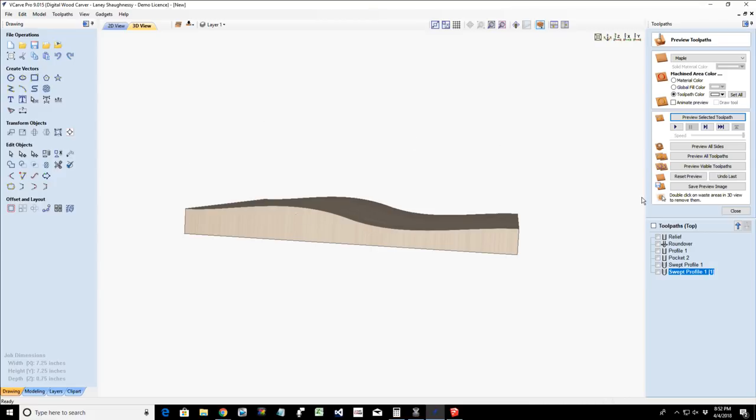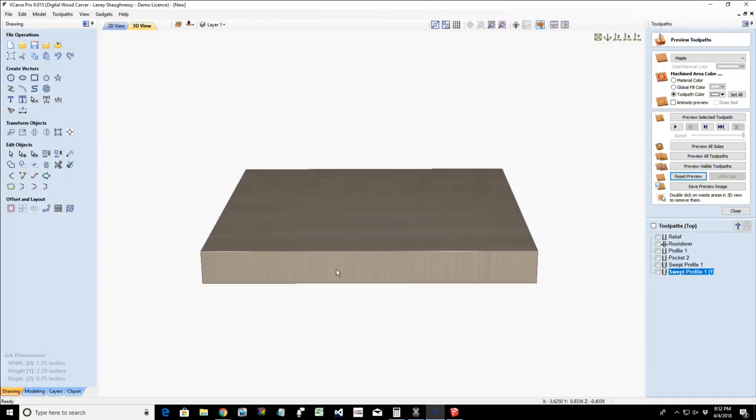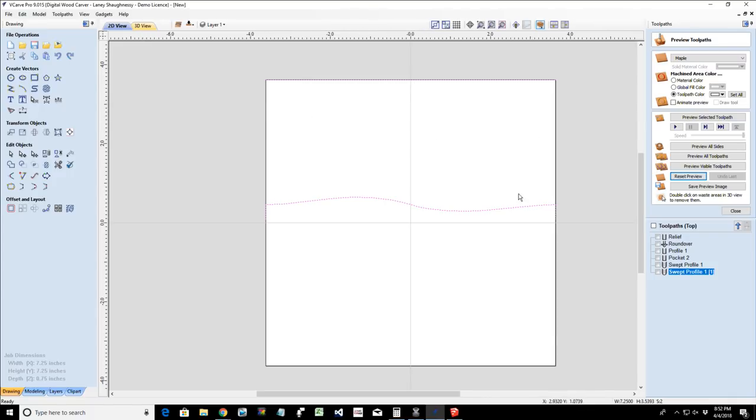And then that whole solid block with my curved little profile in there, my nice little veneer in the middle, I can now bring that back over to the CNC. I can create my ring sizes, and then I can do the same relief cuts. If I want to round over, I can. I don't have to. I can do that on the sander. I can take that with my little oscillating sander, or if I have a random orbit sander, or just sandpaper, hand sand them. There's nothing wrong with that.